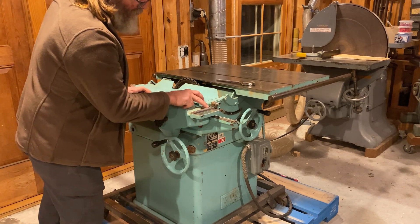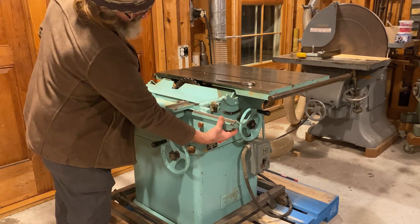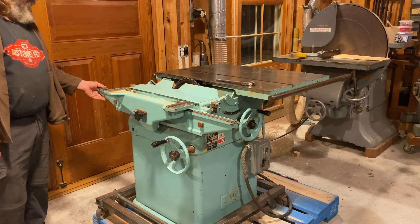Special bearings that look like cylindrically ground, which are run on drill rod, embedded in a casting here, which is heavily webbed. Very, very cool.